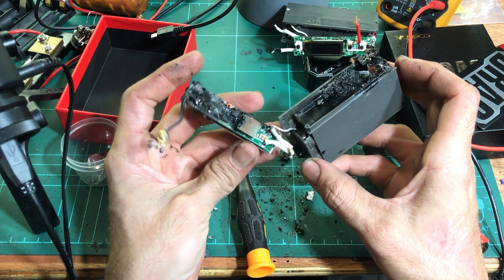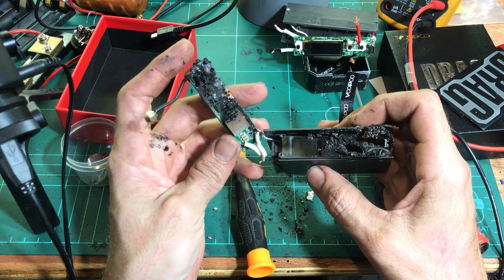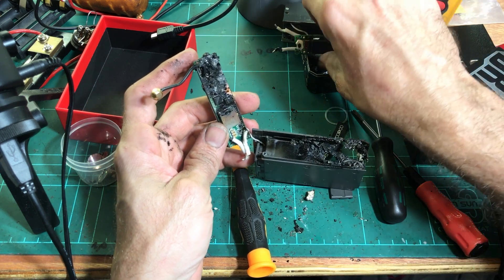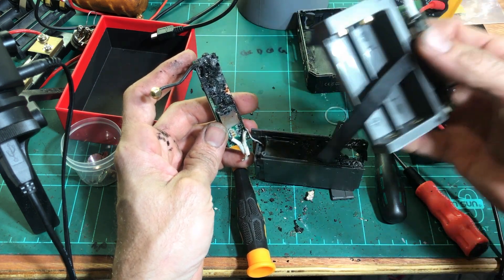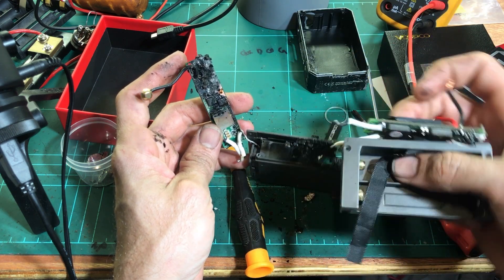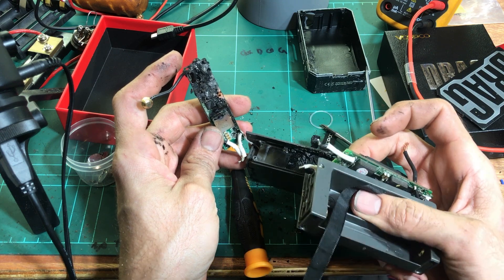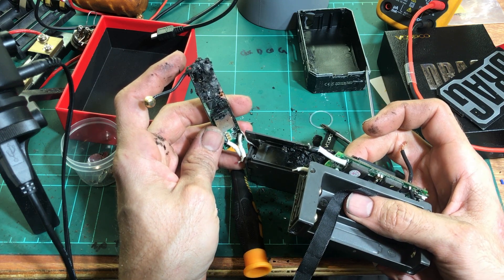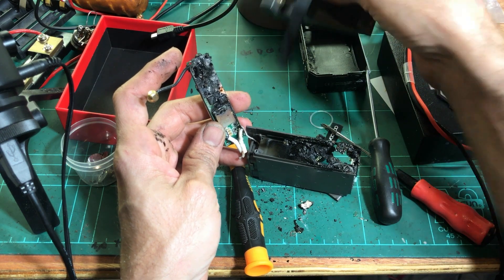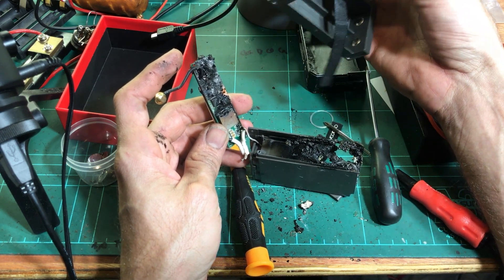That's just melted plastic. So it's more white under there — that is melted screen carrier. Yikes, look at that. It's actually quite different on the back compared to the Alpha. Well, it's a 157-watt board, the Alpha is rated as a 200. So it's only got one inductor, one big inductor. I need another drag board for comparison — I might be able to get a picture of a good drag board online.